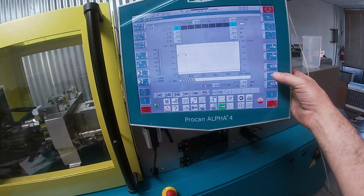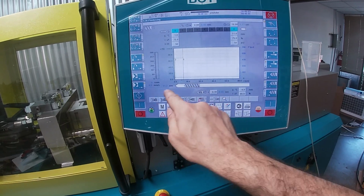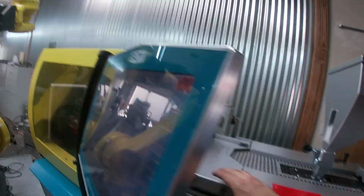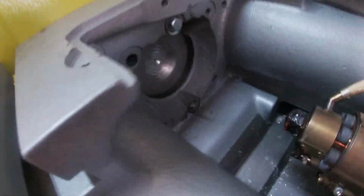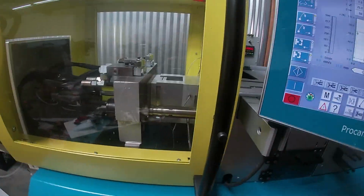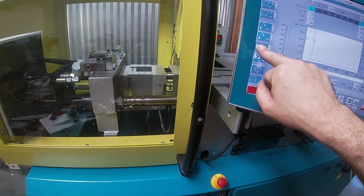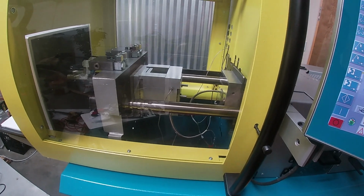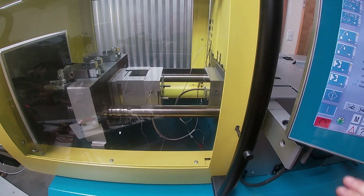So I'm going to auger in fresh plastic. You can see this is the depiction of the auger. So we pulled in 11 millimeters of melted plastic into the injection unit, which is this guy right here. You can see the hot nozzle tip ready to go into the mold in the front of the molding machine. Now I'm going to back the mold out. You can see how the stripper plate moved forward by a few millimeters as it opened. And let's go ahead and see what happens.